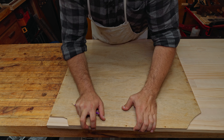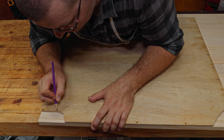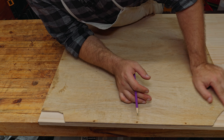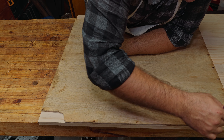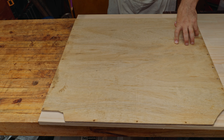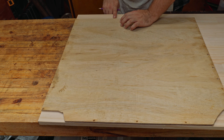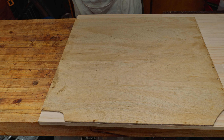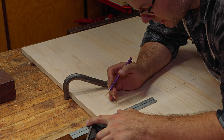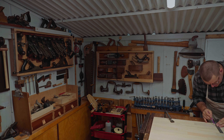Let's just tuck the board up on this corner here — I have some sort of a cutout like this which I'm going to do a little more carefully, maybe get a nice round in here using the coping saw. Up over here I'll probably use the coping saw as well. So what I'm going to do is just mark these angles I know I need. This strip here is probably what I'm going to use for the foot — about 50 to 60 mil — and that's what we'll use for this part of the foot on the new leg. I'll put a square on here and give me that final line so I can follow it with my saw.